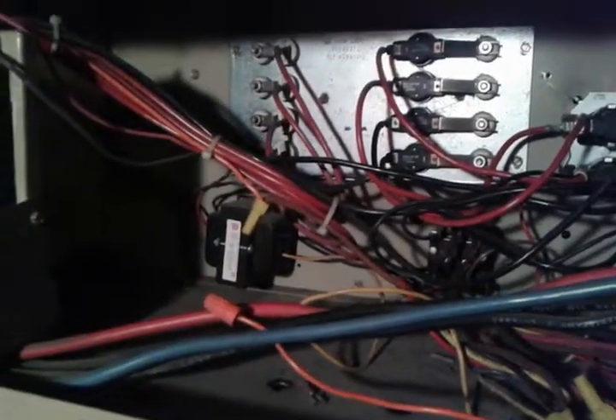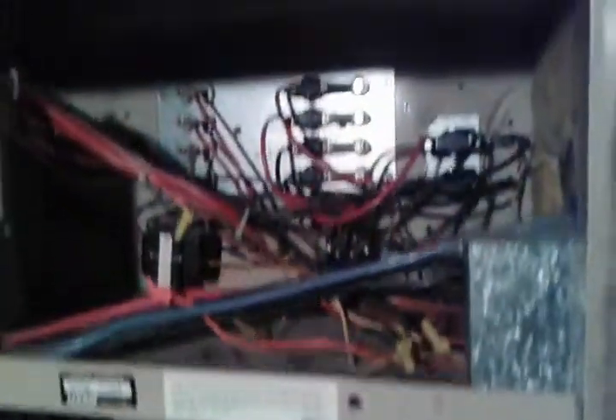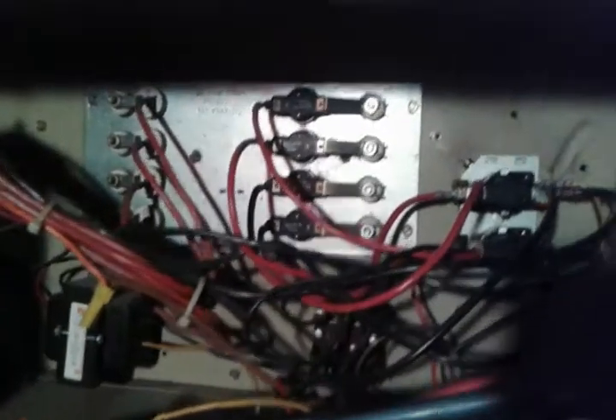The heated air goes to each of the rooms. Here's our return air over yonder coming down from one of the grills in the floor up above us. The cool air comes down naturally — cool air falls — so it falls down, comes down this ducting, but not before passing our air filter. It gets all the nasties out of the air before blowing it up through the heating elements. Once it passes the heating elements, it collects the heat and transfers it through our ducting system.